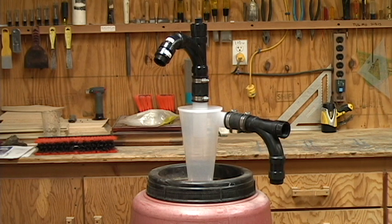We're going to give this a whirl this year. I'll test it out probably in the next couple of weeks. From the first generation — we were just using a bucket in that 70-gallon supply tub — we were getting maybe 20 to 24 buckets before the water just got unbearable to work with. After we made the tailing sluice and played with some filtration last year, we were getting up over 35 to 38 five-gallon buckets of minus half-inch material before the water got to that condition. So if I can target maybe 50 buckets with this system or more, that's a step in the right direction.